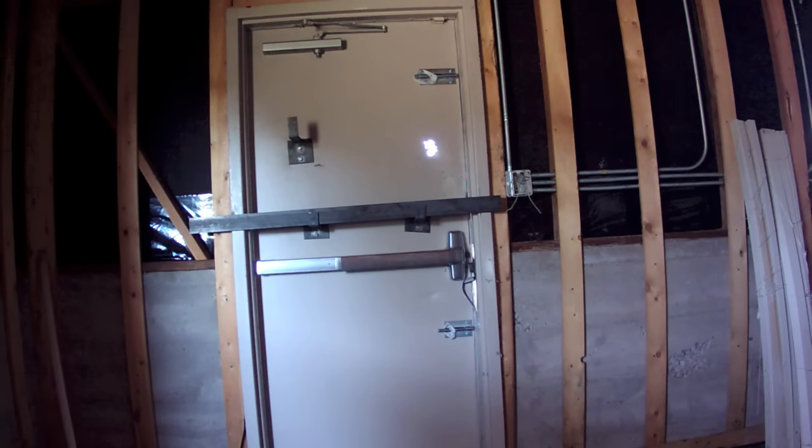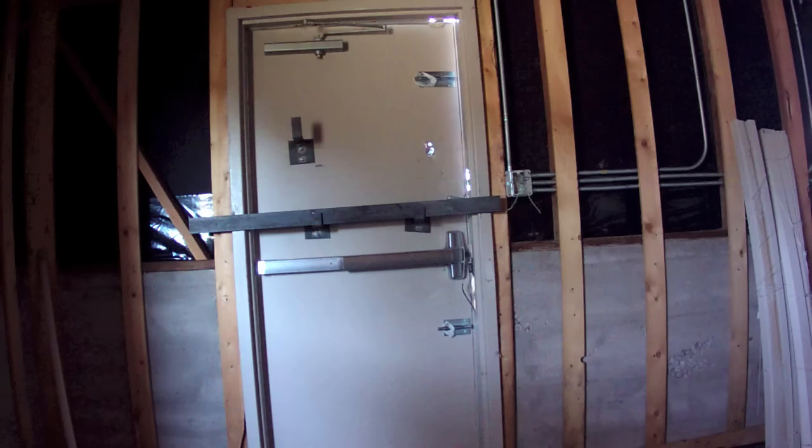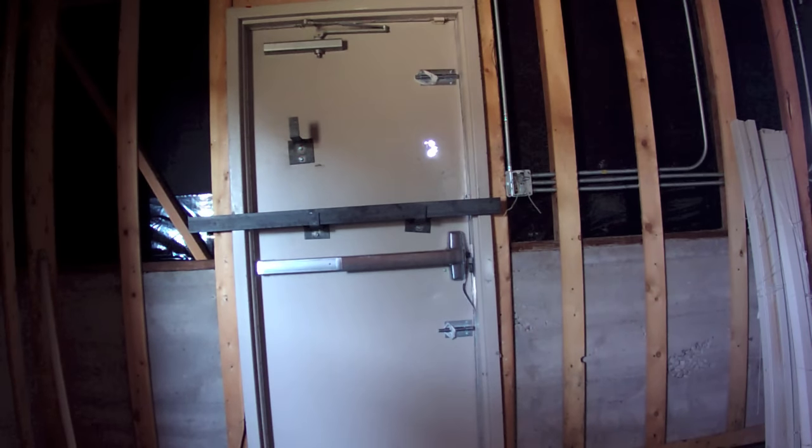So we're moving up high and going back in conventionally above the drop bar now that we felt it when we were prying outwards. We're just going to give it one more run conventionally and see if we can overcome and bend that steel out of the way. Even though this was half inch steel, we still bent it out of plumb probably 2 to 3 inches and could have overcome it in a different situation. Once we feel that it's steadily in place, we go to attacking the mount again.